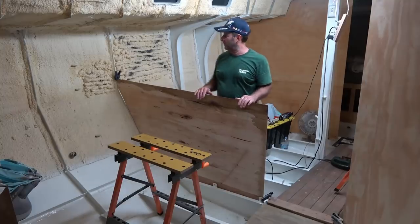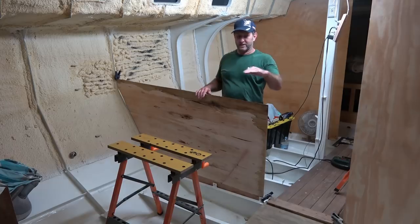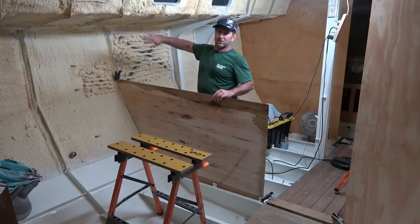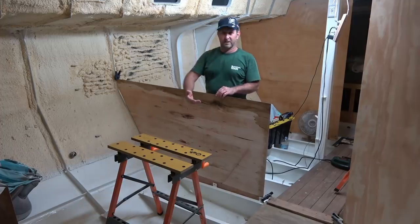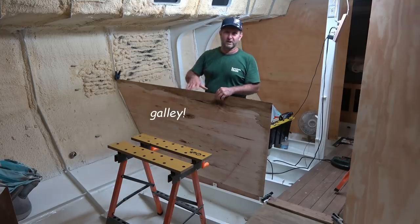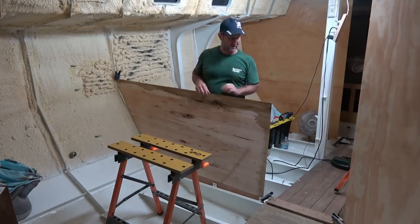This is the next bulkhead which will be another 300mm high. We'll go along and then scallop up to this side deck beam. The purpose of that is there will be 240mm of a splashback so that when working in the kitchen you don't get things falling over into the saloon dining area.